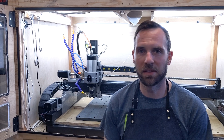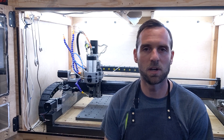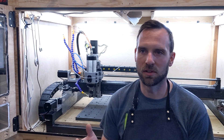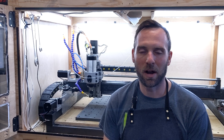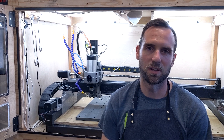It might have been that I was a little too aggressive on my test coupons, and it was just too much on the machine for the improvement to be visible in that type of cut. Maybe with some lighter finishing passes I'll see a little bit of improvement. Overall it was still a fun project to try to implement on the PrintNC, but I'm going to say it's probably not really worth the effort to go and fill the X-gantry with polyurethane foam.